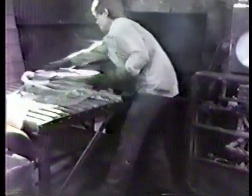This is 570 breakdown. He puts his chemicals in first, Amberol, etc. Next goes the black, and finally the polymer. Closes the door and lowers the ram, and then brings up the next batch of material.